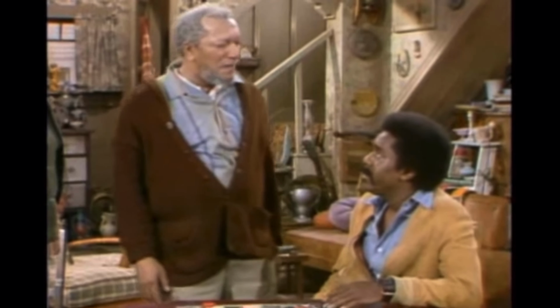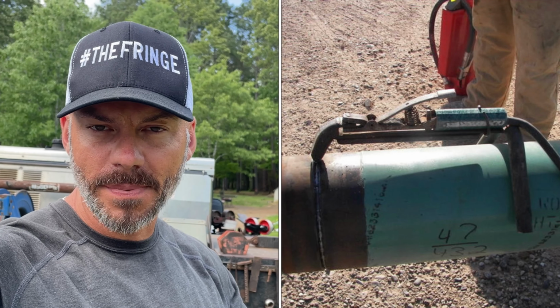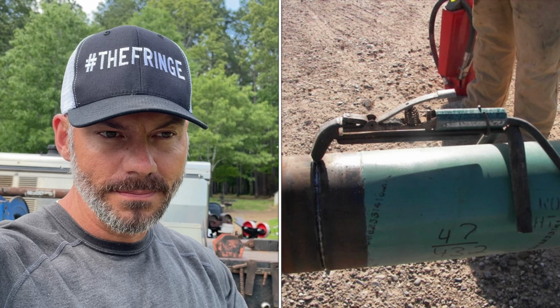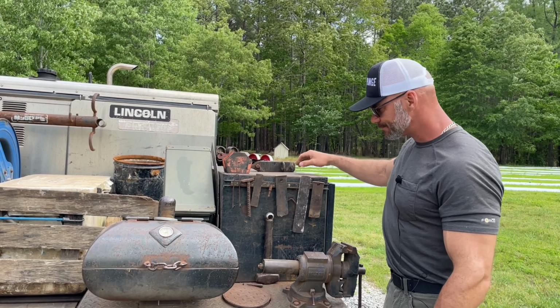I just realized when I was editing this video, you still don't know what a grasshopper is. You big dummy! Or what it's used for. So I'll put a picture of one up here if I can find one. There's nowhere to put your ground on a round piece of pipe, and they won't let you hook it on the end. You know, you have to be grounded off on top of that last weld that was just made. So that's why I use a grasshopper. It's a place to put your ground. So that's what that is, in case you wanted to know.